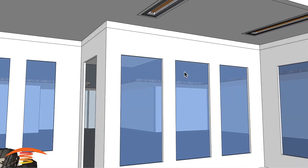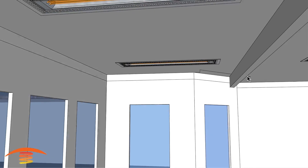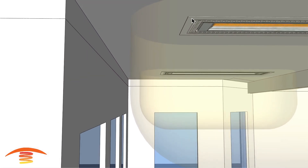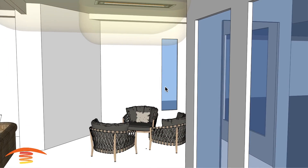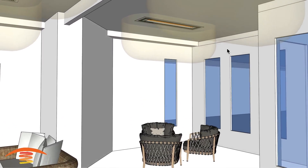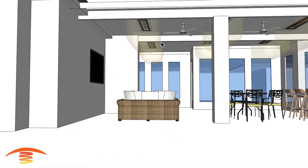Over here, I came from the edge of the unit — not the flush mount kit itself, but the edge of the unit — 18 inches from this beam to that edge, and that's true on this one as well. There is a clearance requirement: 18 inches from the edge of the heater out on all four sides. Over here I took the center point from this beam to this wall and used that as the center point of the heater, still 9 feet center to center from the adjacent unit.